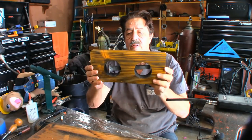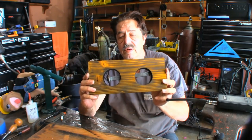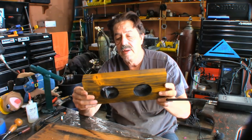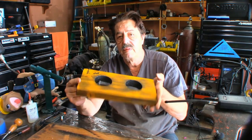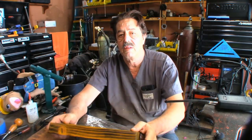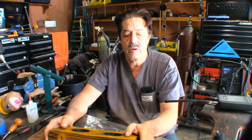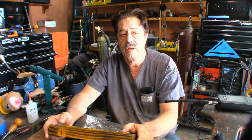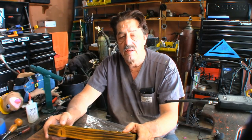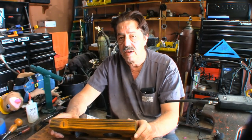This one I don't have totally finished yet — we'll do a little bit of decoration to it before I finish it, but I'll add a photo at the end or in the next video showing you the completion. This one is done and ready. After I got all the glue off, I sanded them with 80 grit, then 120 and 150, and I stopped at 150.